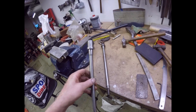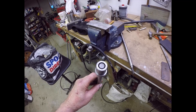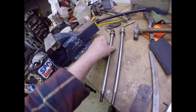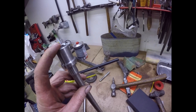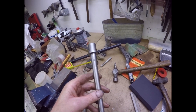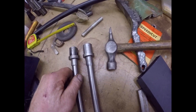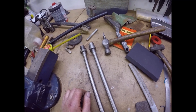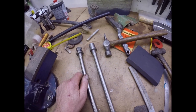That's it for this week folks. I haven't got anything more done. I think what I'll do is set my brazing hearth up and fill it with brass, or I could just weld it around the top. On Monday I'll look and see if I can get those flats machined onto there and still leave a reasonable wall thickness. I should have reduced the diameter there and not drilled it out so much, but if I have a decent wall thickness I'll weld it around the top, turn it smooth, and machine two flats on it.